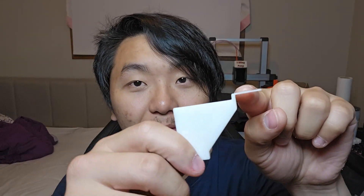I just love how the filament is not flying all over my room anymore. That's all with the installation and how this thing works with the Cobra 3. Now I'm just going to show you the process of how I got here. This piece right here was the first test model, and I kind of screwed up — this thing is not supposed to go here, it's supposed to go up. But I got the idea of how to design it next. Then comes the second piece — I made the hole for the screw, but this hole down here was a little bit too small so the screw couldn't go in. So I redesigned it to make two better pieces.